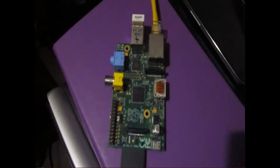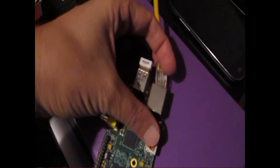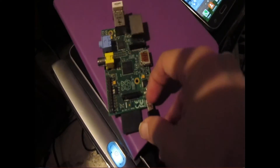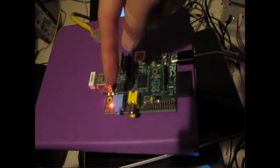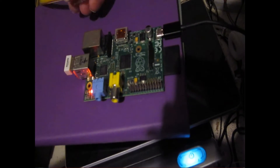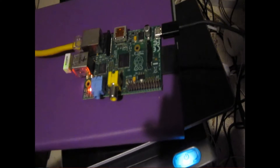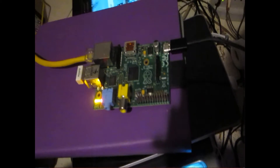The first thing we're going to do is take a look at our Raspberry Pi. Here's the Ethernet cable - we're going to hook that in here. Let's first plug this guy in. It takes a micro-USB for the power, and that goes in here. We're going to plug the micro-USB in. We'll get a bunch of blinking lights up here, and that tells you that the system is booting up. We plug the Ethernet cable in here - this is a Raspberry Pi 1. A bunch of yellow lights come on to show that the Ethernet is hooked in, so we're hooking that Ethernet into our router.